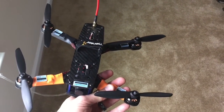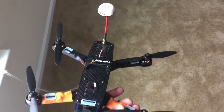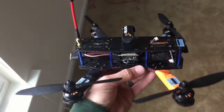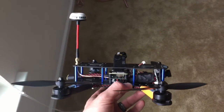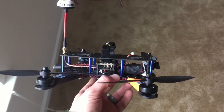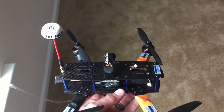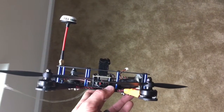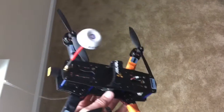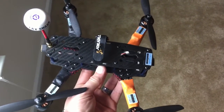Looking forward to this weekend to test and fly it. I built one for a friend — we actually worked on it together — and that one is the exact same setup. His is extremely fast. The all-up weight on this with the full FPV gear, minus the battery, is 403 grams — about 14.2 ounces, so it's under a pound. I'm running a 4S 1800mAh 40C battery. Hopefully I can add some initial flight testing footage and see how fast this thing is.